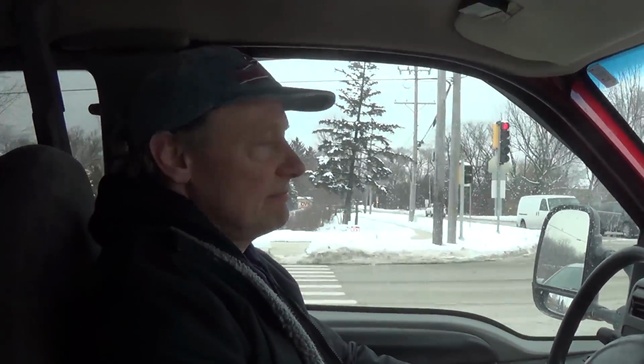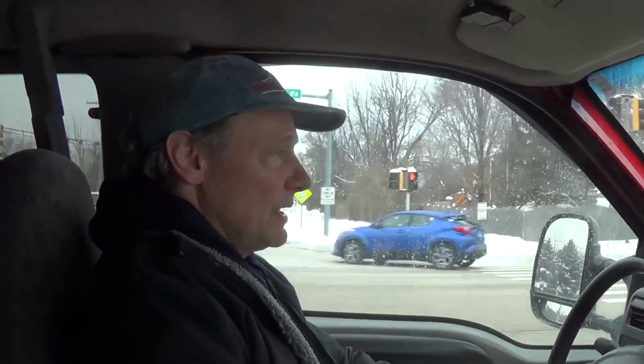I've had mud that has frozen not solid, not fully solid, but it just got cold enough where it froze a little bit, started to freeze around the sides of the bucket and everything else. And I caught it, and I was able to thaw it out, and I was able to mix it well, and I was able to reuse it. But if it freezes solid, throw it out. It's garbage. It's just garbage mud. All the paper is going to fall off the walls.